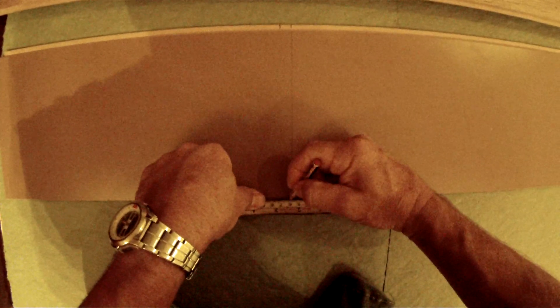Let me get a straight edge. This is also my tool for tapping the board in later — it's actually a dedicated piece of plastic for fitting laminate boards, which has a groove in the side. This particular groove isn't actually deep enough to use on this board, so when I tap it in I'm just going to take the plain edge, rest it on top, and give it slight taps to finally push it in. But for the moment I'm just going to use it as a straight edge to mark this, then we're going to cut.